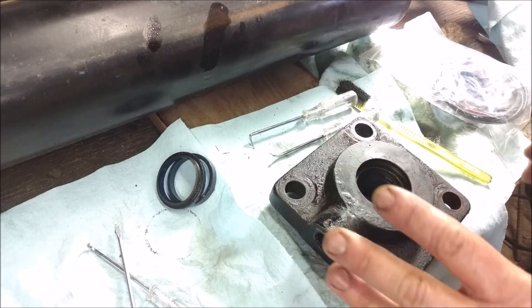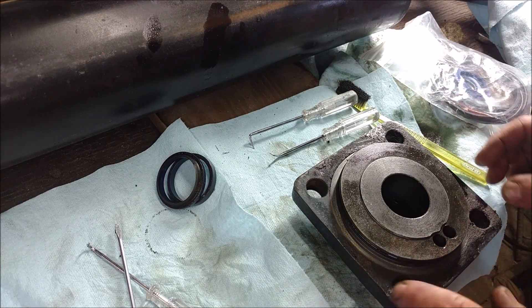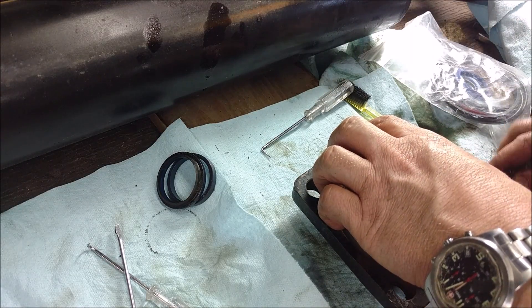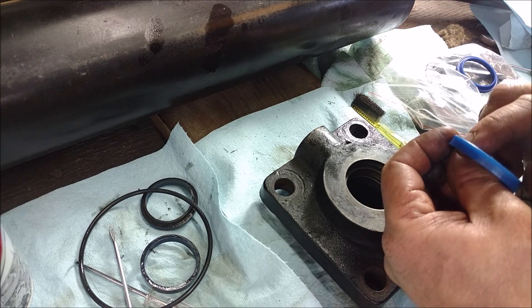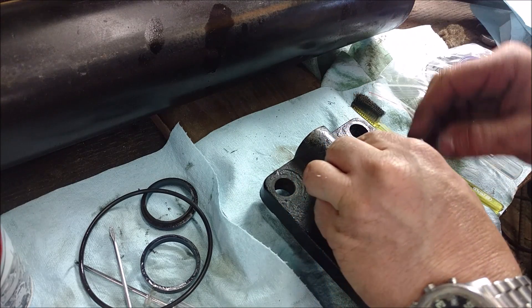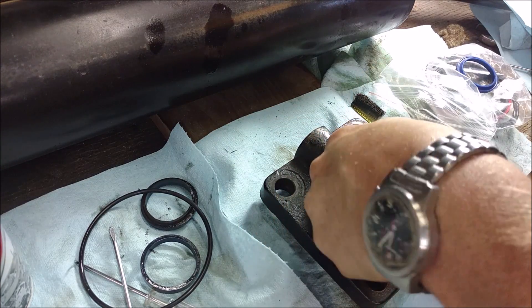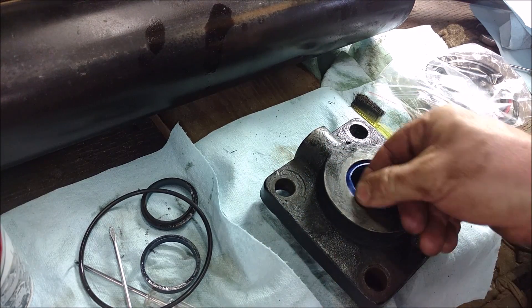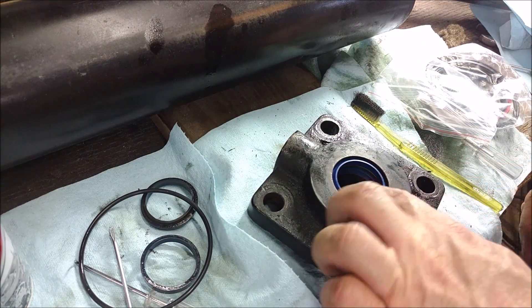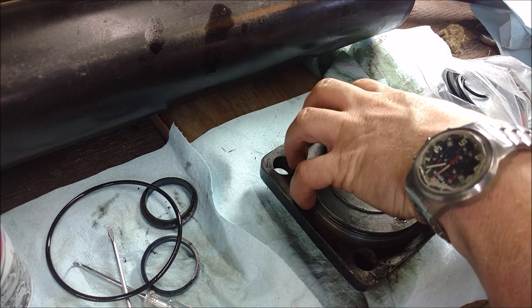Now it's just a matter of cleaning it all up. I'll probably put a new O-ring seal around the outside right here after I clean everything up. The O-ring seal is just an O-ring, but this is an improved, bigger groove with more of a lip. We'll just be able to put that in, pinch it in the middle, and roll it in — there we go. That seal's in. Now put my front wiper in, and that just keeps the other seals clean by wiping all the junk right off the front. There we go — that's rebuilt.